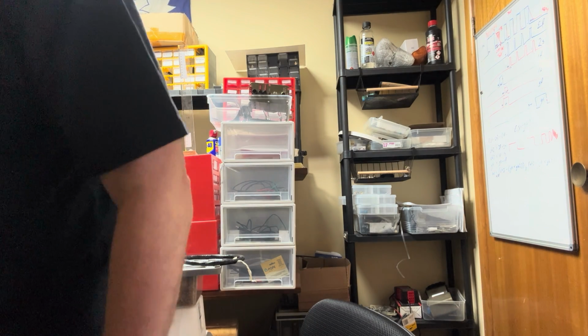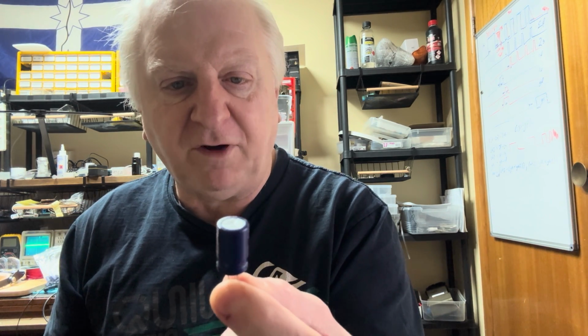Okay, I'm back online. Yeah, they're about that size actually, but these are 10 volt, 3300. And yeah, I'd replace it with something like that. It's much better than what's in there. More filtering, the better. So when you pull these things out, they're all covered in white paint. And if it falls out of the board, you won't know which way it went in because the board's not marked. So when you take it out, make sure you don't rotate it